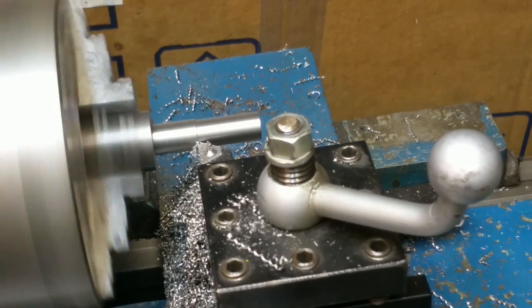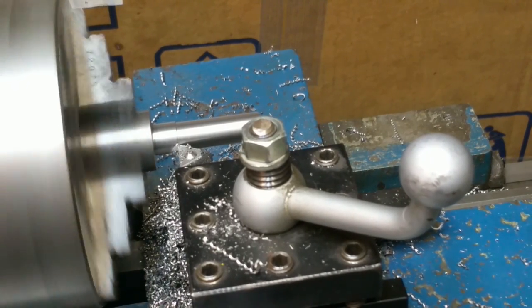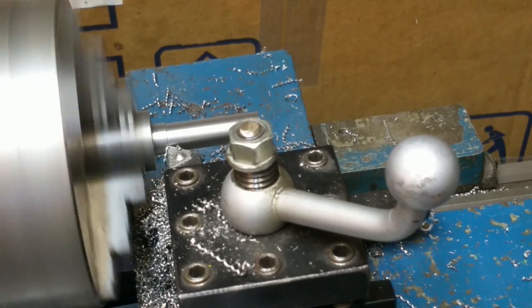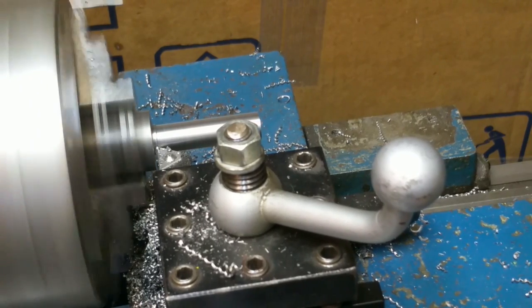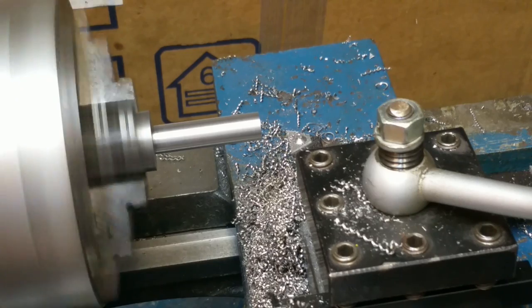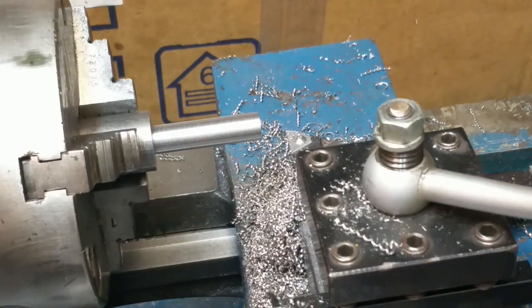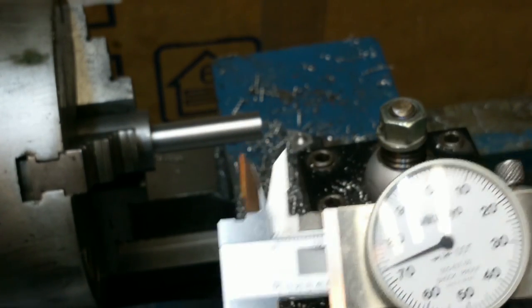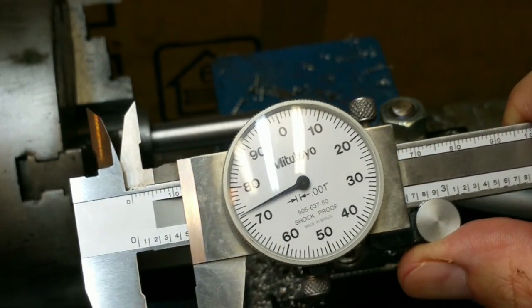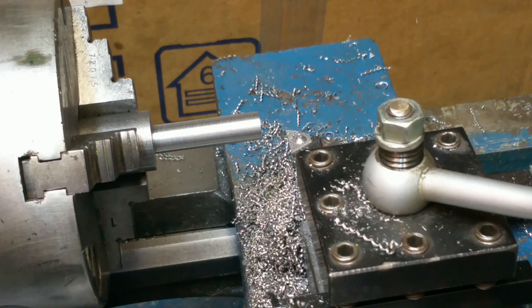Okay, we're getting close. The surface finish is looking a little better as the material removal rate's decreasing. Still making a good chip though. I've been consistently going in an X feed of 20 thousandths on the cross slide, which is 40 thousandths OD per pass. Remember, we're going for 0.4375. We are at 0.475. So we need to go from there to, whoops, there. We've still got a little bit more to go. We'll take another couple of passes and then sneak up on it.